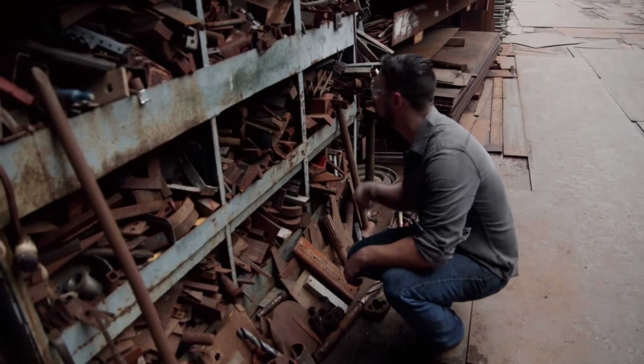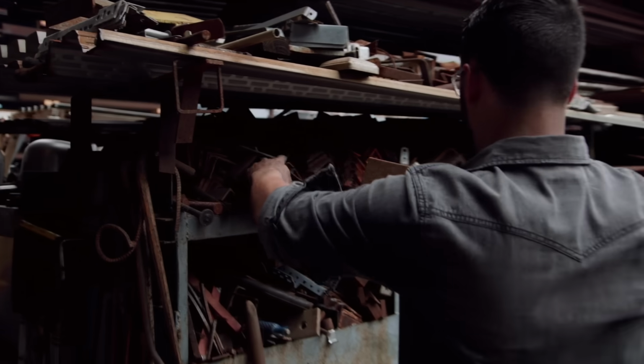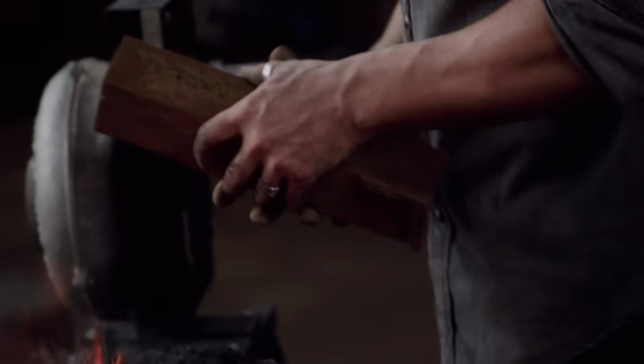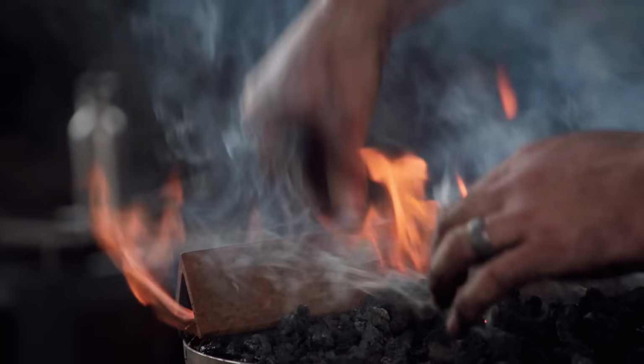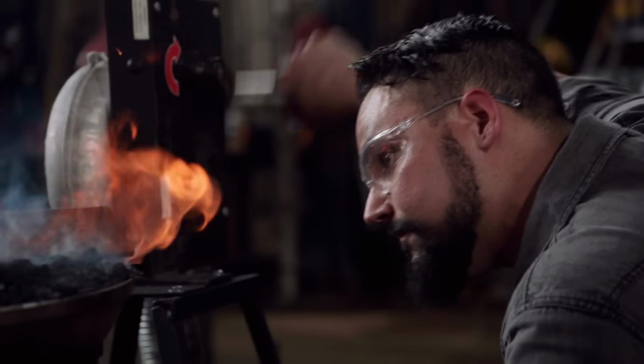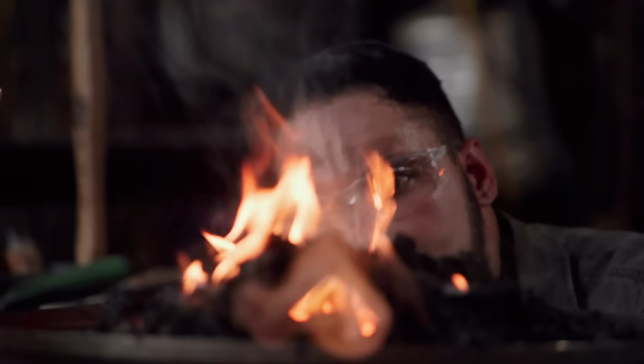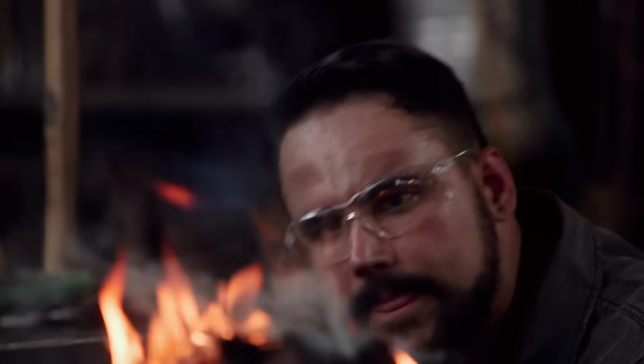To make myself stand out in this challenge, I am going to pull a lot of little tricks. So I go off to the scrap piles, and I find a couple pieces of angle iron, and I stack them down the middle of my forge. Michael's actually made himself a heating chamber. So instead of sliding back and forth and playing with it, he'll have 360 degrees of heat around that blade. He puts that in there, gets it nice and even for a quench.